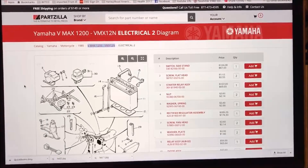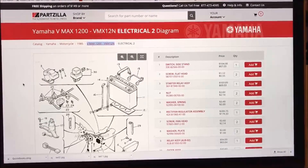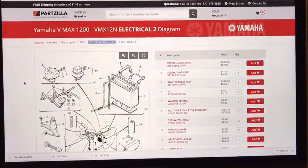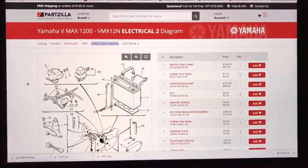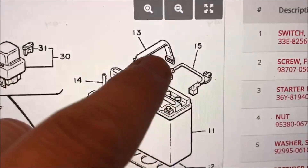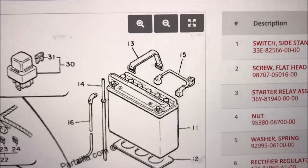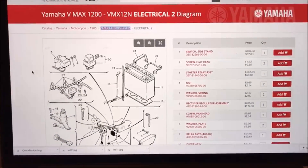First off, we think about the motorcycle — the Yamaha V-Max is known to vibrate a lot. It's a big, powerful, torquey V4 motor and that thing will shake. Something you know about batteries, especially being a technician for a long time, is we see quite often that the battery strap is missing, which is the case with this battery. I've already talked to the customer about it.